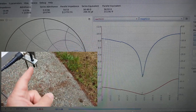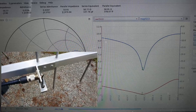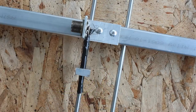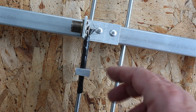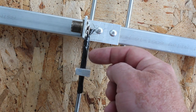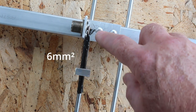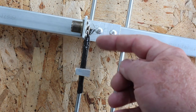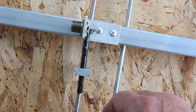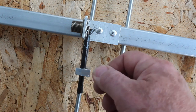Getting this all tuned in took quite a lot of time — getting this just so. I'll go over some of the construction details and give you some tips to save you time and help you learn from my mistakes. It's basically all aluminum, except this little piece of copper pipe in here. One thing I would change — it caused me some trouble — I used too large a piece of copper pipe. Solid copper wire from 12-gauge house wiring would have been a better choice. Also, you'll notice it's simply wrapped in tape; the antenna is not really complete yet. It should probably be covered with heat shrink or rubber tubing.